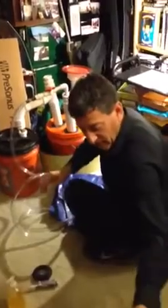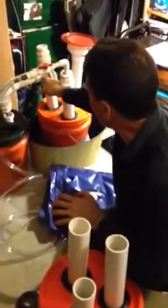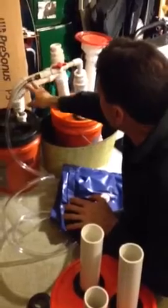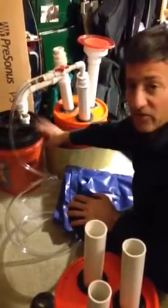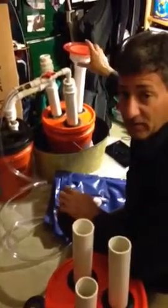And then here on this slurry pipe that I talked about, which is shorter, you'll see that I put a sewage tee, a sanitary tee, which is the cheaper tee, and then it comes out and goes through an elbow and then down into the slurry or fertilizer collection bucket. Because every time you feed it a cup of food waste, you're going to get a cup of fertilizer out.